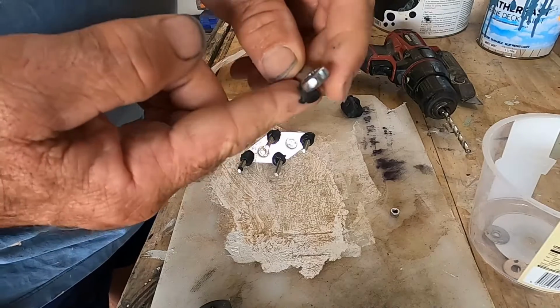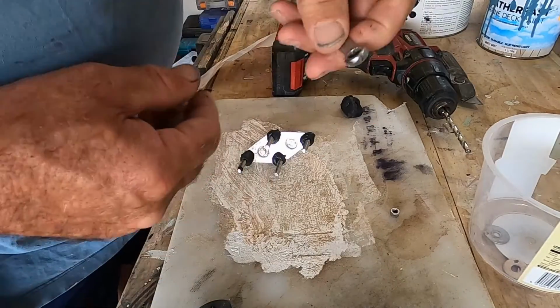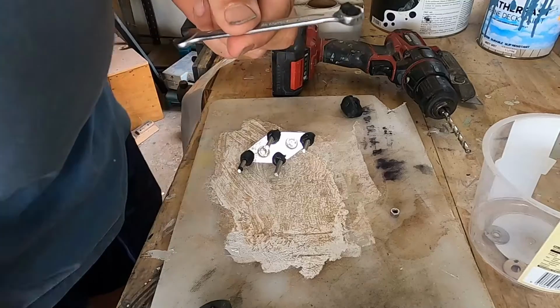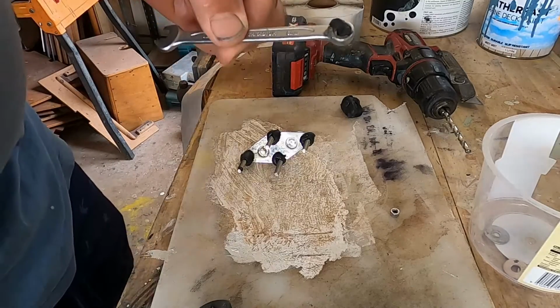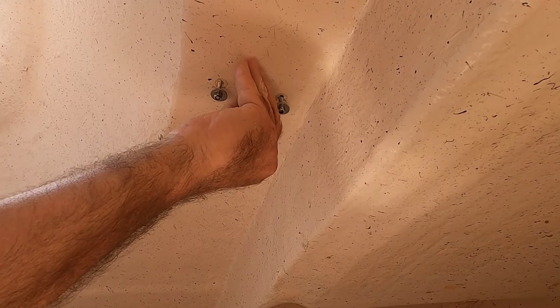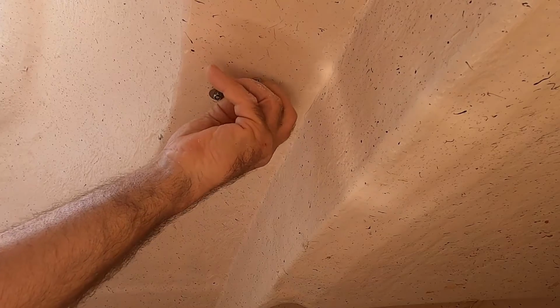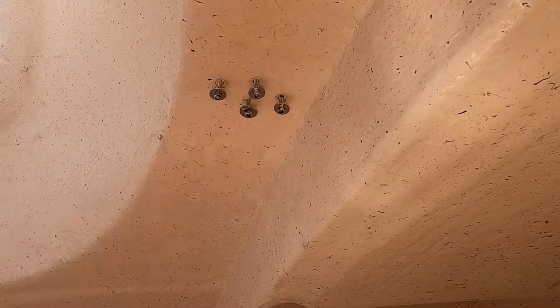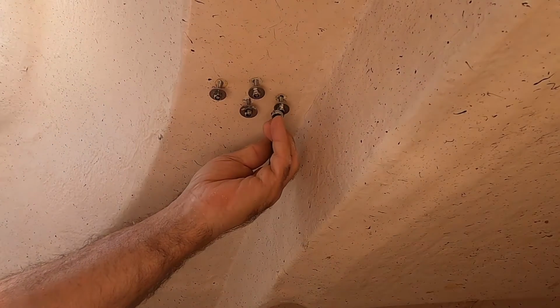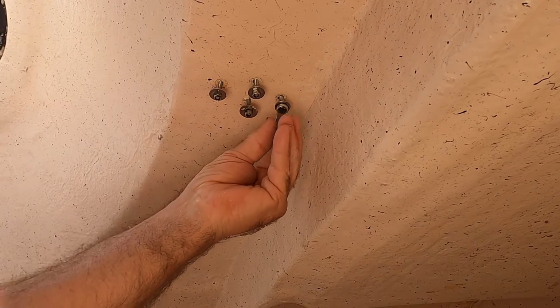We all know what a pain it is crawling in and out of the boat if you're doing the job on your own and clenching, say, vice grips on the inside, only to have them fall out when you're halfway through screwing them tight. So I put a little glob of butyl mastic on my ring spanner, and that makes sure that the ring spanner just won't drop off. It also gives a bit of flexibility so that it can accommodate the different angles that are involved.